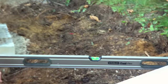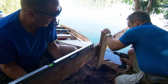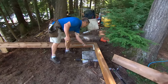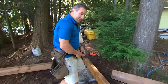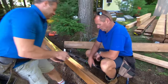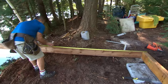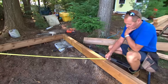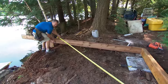At this point, it's important to make sure it's perfectly square. Sometimes people use a square like this, but it's not very long and not very accurate. So what you have to do is measure out six feet this way on the outside, eight here, then measure across — it should be 10 feet. In this case it's an inch less, so we just have to move that out to 10 and it's square.